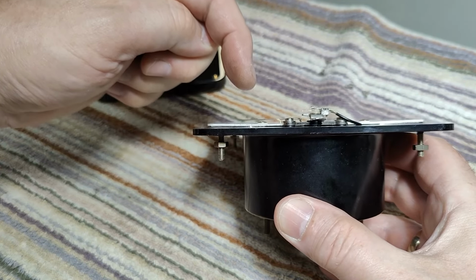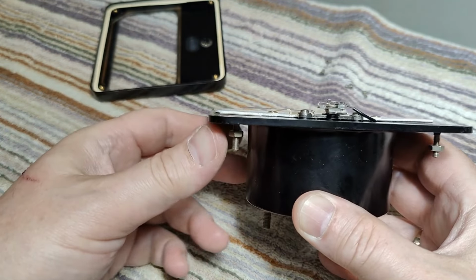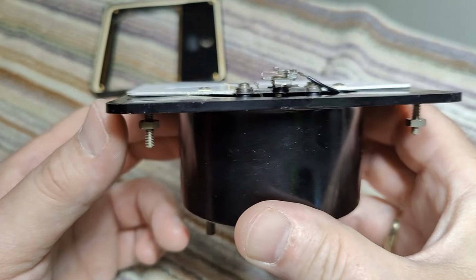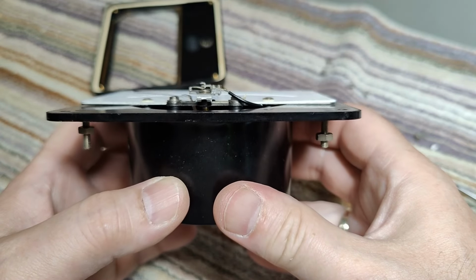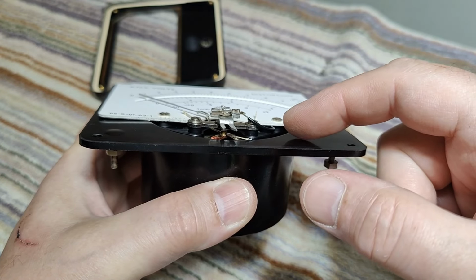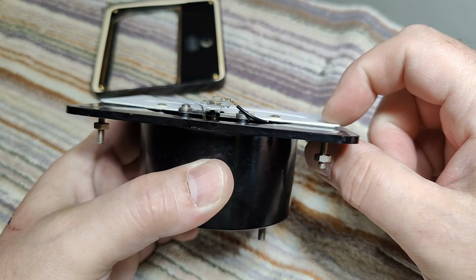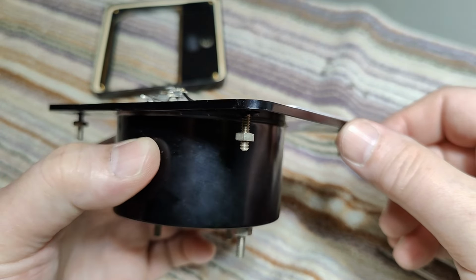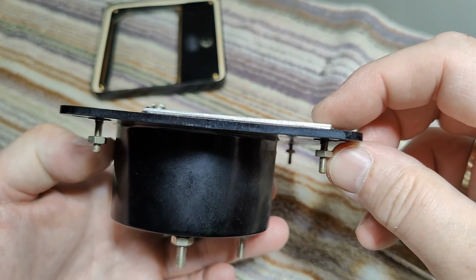So when these screws here are tightened a little bit too much, see what happens? It bends up here. And it's actually quite a lot this happened here. So this was not assembled correctly. And that is something I really like to fix. It's probably because these standoffs down there are a little bit too short. So when you tighten these two screws, you cause a bend to the scale. How stupid is that? Yeah, oh, here it's a lot. See?